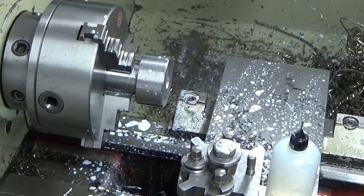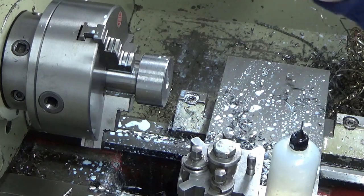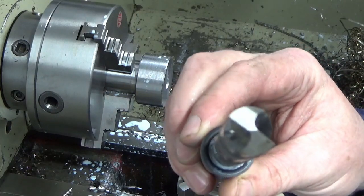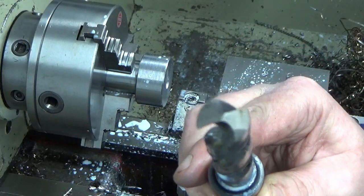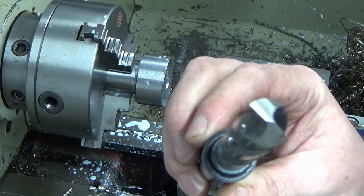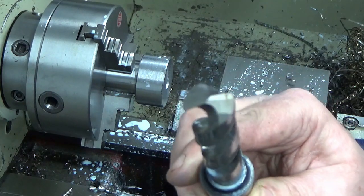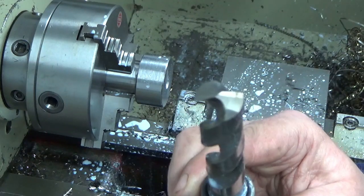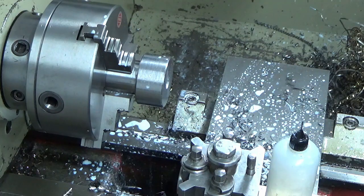And when you have work hardened it, once you get under that work hardened surface and start cutting again, as long as you keep the pressure on and you don't let it get too hot, it's okay. But if you look at that drill, that doesn't look like a drill that's been cut in hardened material. I mean, it's got warm, but it sounds hard, but that wouldn't suggest to me that that material's rock hard. Very, very strange material, this. It's certainly a mystery material.